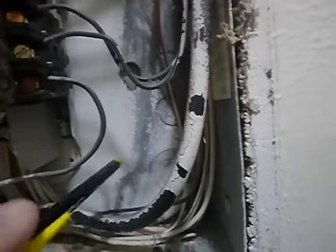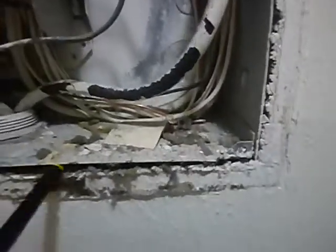The bonding location — this is a multifamily unit, so I'm not sure about that; I'm treating it as a single family. This probably doesn't apply, but the bonding location should be labeled inside the panel. Gaps between the box and the drywall should not be larger than an eighth of an inch.